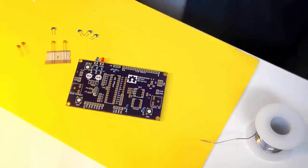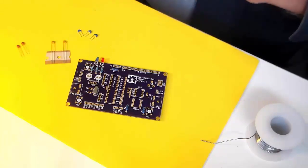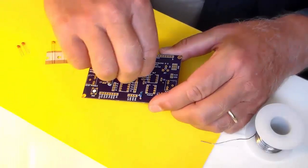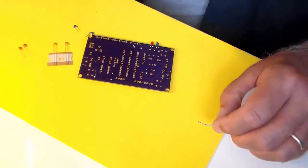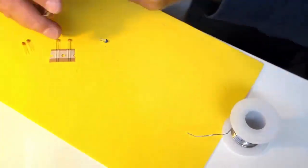There's a dollop of paint on this blue capacitor so you can tell it from the other three. Leads on the capacitor are mustard colored and the last two are red. The blue capacitors are going to work with our tone decoder chip. Make sure you put the one with a dot of paint in C1. The three blue ones are all the same value — they'll go in C2, C3, and C5.